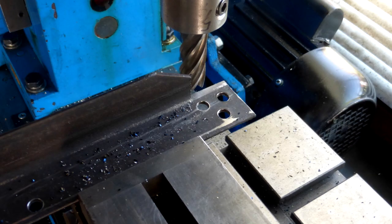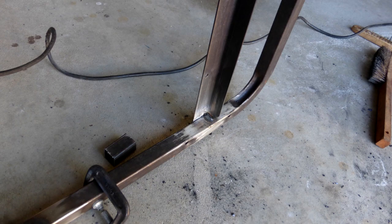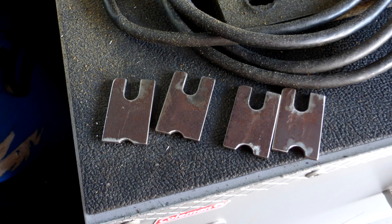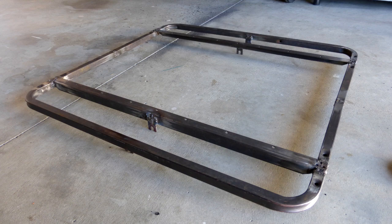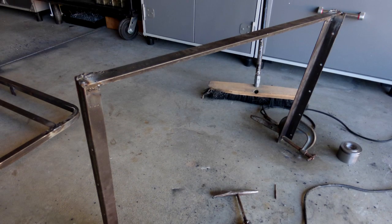I then notched the ends on some of the angle pieces, and fit them in the square where they would be used to support the wheels on the inside. These were then welded in place. I cut some dropouts for the wheels on the milling machine out of some pieces of plate, though these easily could have been made with a hacksaw, a file, and a hand drill. I made a spacing jig — basically a piece of rod the same length as the wheel axles, with two tapped holes on the ends — which made clamping a whole lot easier, and eliminated the possibility they would end up too narrow or too wide after welding. And look at that, it's starting to look like a trailer. At this point I realized the trailer frame looked pretty awkwardly wide, and wanted to make it longer. So I welded three angle pieces together, and attached those on the front.